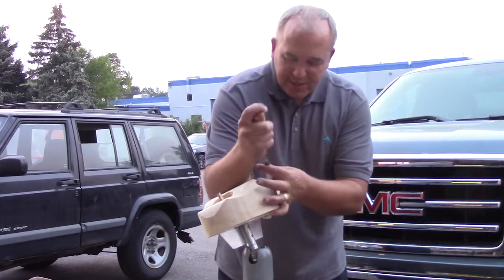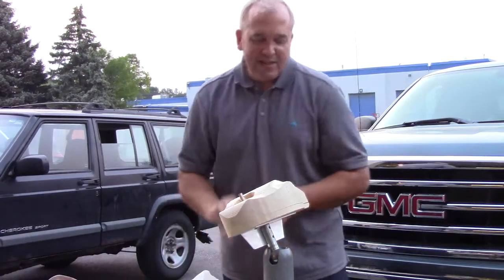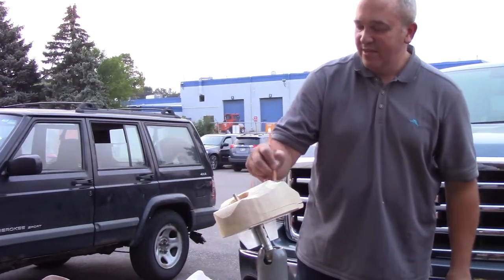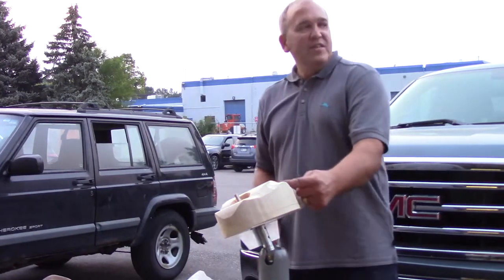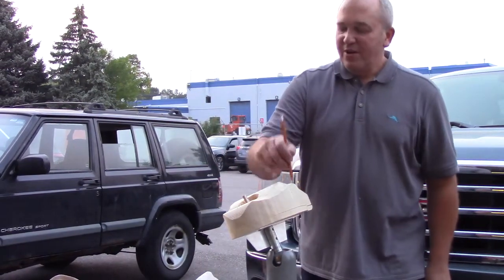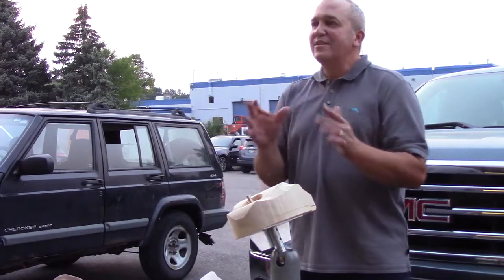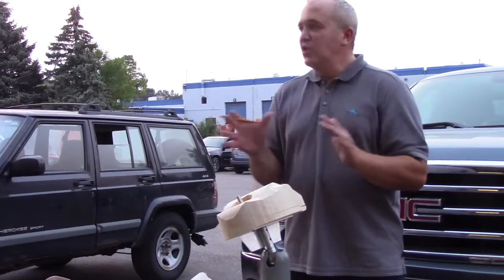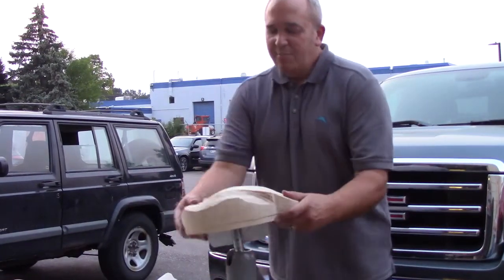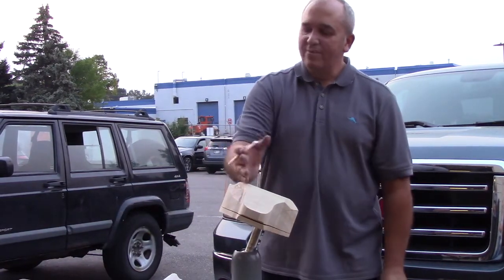What I'm doing is just rounding to that. A lot of times when I get this in, I'll draw a pencil line on the inside of that, and that's going to help you see. Using a pencil is a nice friend. Once you put that line in, it helps you see if you're good from side to side before you go too far. So getting that pencil line in there, you're basically rounding to that pencil line this way and rounding this way.